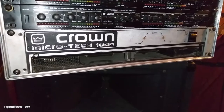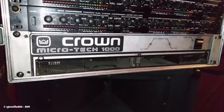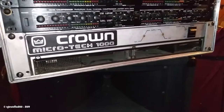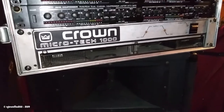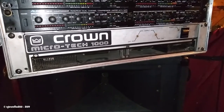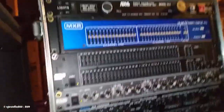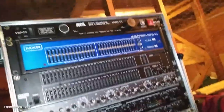The actual watts it's pulling out of the wall are about 1800 to 1900 watts or something ridiculously high. When I kick the thing on, the lights flicker really badly until all the capacitors fill up and it's ready to go. A lot of the older ones like this are two prongs instead of three, and they ground out really badly — it's almost atrociously bad. So I actually have to put a third prong in these. A lot of my amplifiers that use two prongs, I've converted them to three. I could just ground them all to the case, but maybe that's a dumb idea.